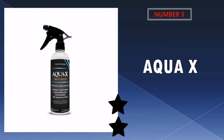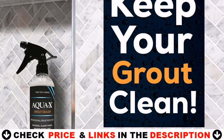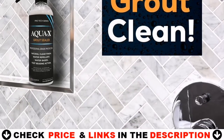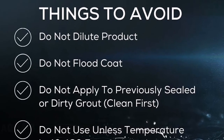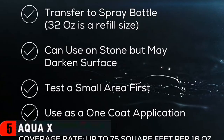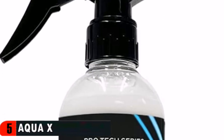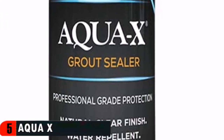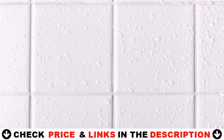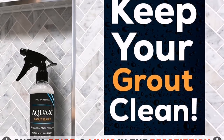Last in our top 5 best grout sealers list is Aqua X Grout Sealer. Whether your tile is indoor or out, you'll need to make sure your grout is as clean and dry as possible to avoid locking in dirt, moisture, or stains. If your tile project is brand new, be sure your grout is completely dry and cured before sealing. Then prep is as easy as a thorough wipe down and drying of the area, including the tiles and surrounding area, to make sure your sealer doesn't get diluted by water. Perform a small test area using the product to ensure suitability and desired results prior to full application. Use the same preparation, equipment, and conditions expected during the entire application. We recommend you do a porosity test on your surface to assure proper product quantity.